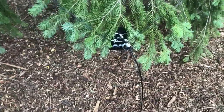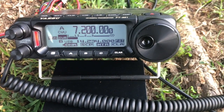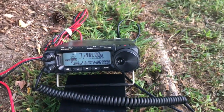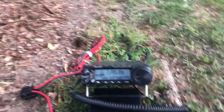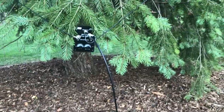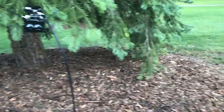How incredibly cool and rustic is that? I'll show you a little bit of the SWR. I got it to tune to about 1.5:1 on 40 meters. I had it literally 1.0:1 at my house. Look at how this thing is only about 2 feet off the ground — pretty awesome. On 40 meters I had it 1.1:1, 1.0:1. This thing is definitely tunable.